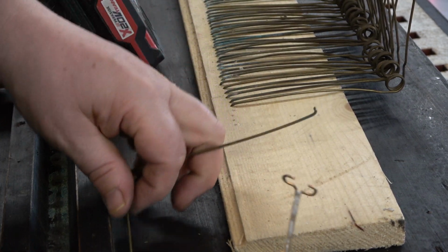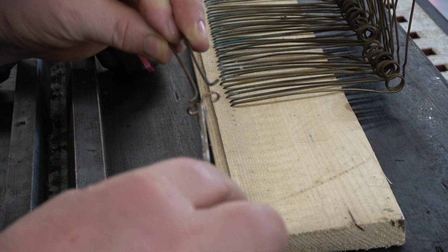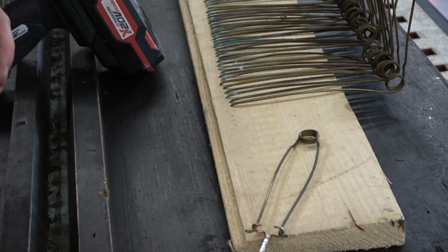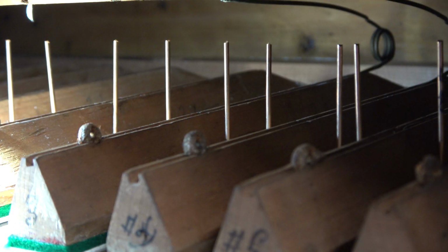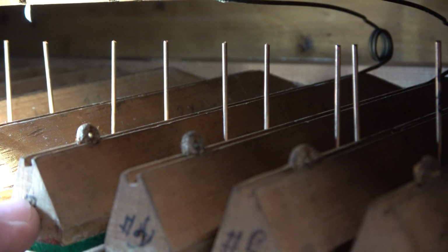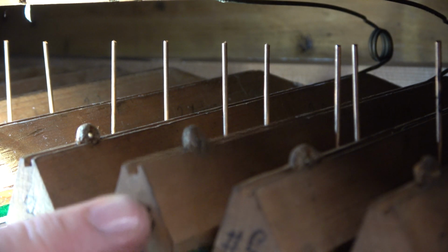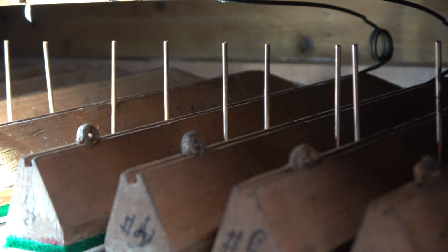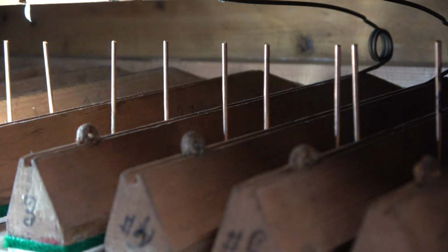So we load it into the spring catch. So there we are, we've got a spring in the spring catch. I'll just move the camcorder. I wonder if any other organ builders ever shown this, or whether it's a silly trade secret. So you can see the springs which are in. That's the previous one to the one I'm going to do. That's the one prior to that. We've still got the pull downs to get, but they are put in later and they're still not here yet. So probably just move my light a little tiny bit.